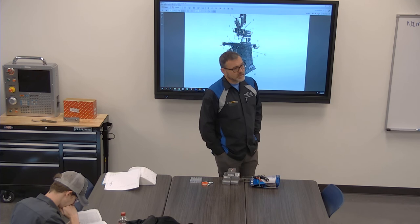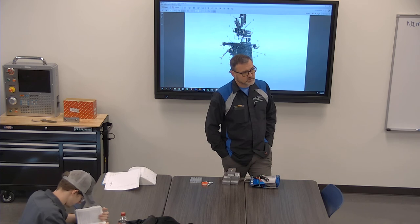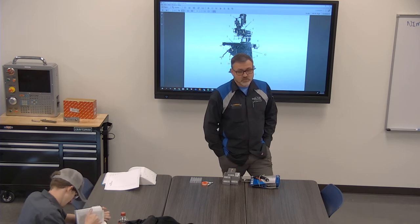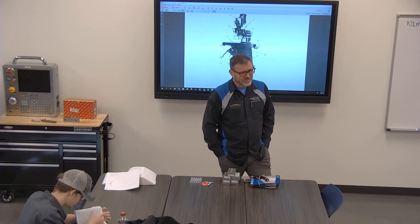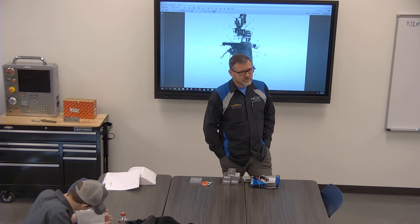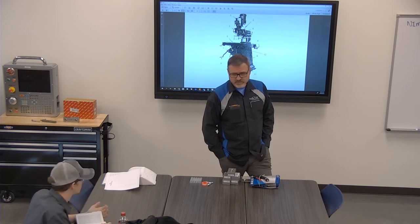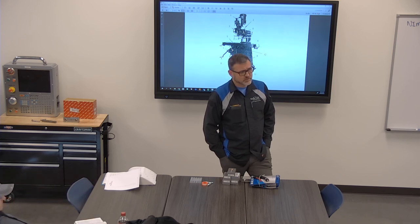I want to know, in my 81-piece gauge block set, how many blocks am I going to have that move in 1,000th increments? Like 134, 135, 136, 137? Or 251, whatever might happen to me. How many blocks do I have that move in increments like that? Because I think your 81-block set starts at 50, then goes from 50 to 100,000ths. Then has a section that moves in tenths, like 100, then 101 tenth, up to 9 tenths, and then it moves to 102, then it moves to 103.